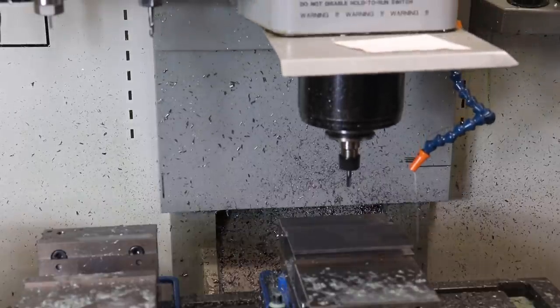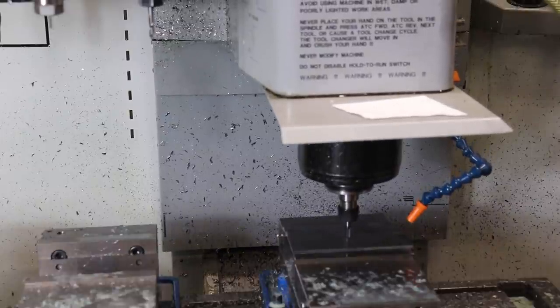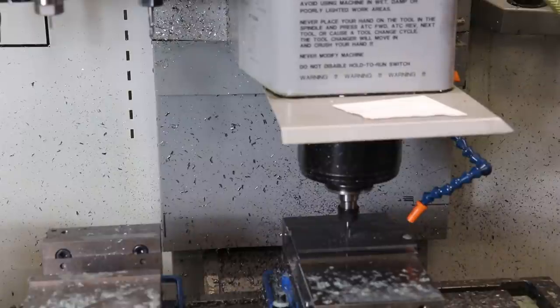And then I'm going to come down and touch off and basically find the top surface of this steel plate here. I'm in metric mode. There it is. So we'll back up a few microns, and then we'll go left and right. We are taking off a little material. It took 3 more microns off, or about 1.5 tenths. We're still cutting. I mean, the surface finish of this steel isn't great either, so maybe cutting off the peaks and leaving the valleys. I'll bring it down a few more, and then the rest will be spindle growth from heat. Tool offset measure, so I think we are set.